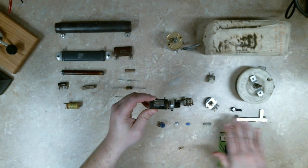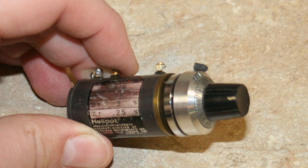Now these are all carbon film. This one is wire wound, made by Beckman Instruments — the brand name is Helipot. This is, I think, a 25-turn wire wound helical potentiometer. It's very high accuracy at 0.25%, and it has a graduated dial.